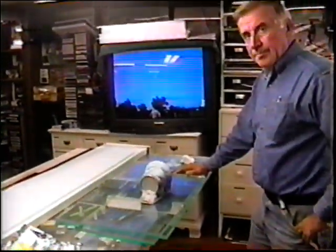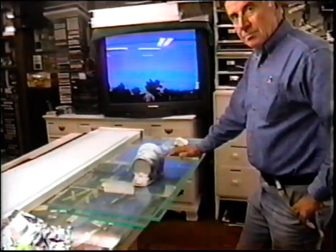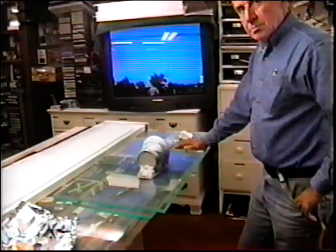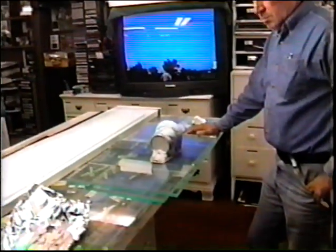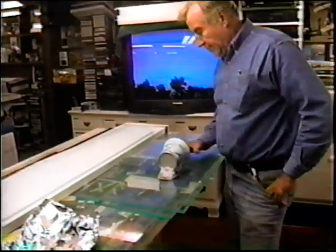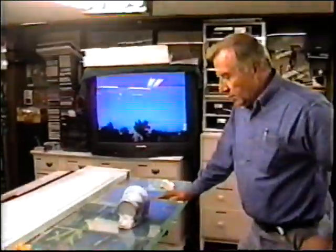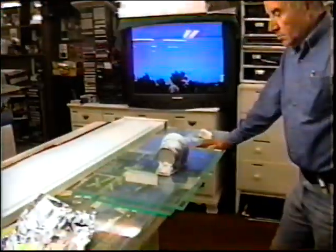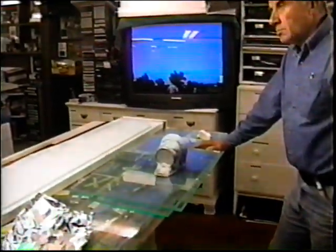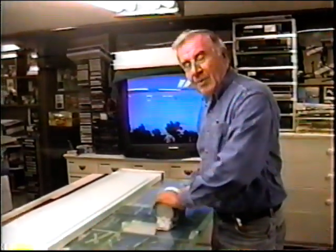I have to shoot this. Yeah, of course. It can't be brushed. You could brush it, but when you go to put the clear on with a spray gun, just keep putting it on. Put 100 coats on. It doesn't matter what it weighs. No lines, no bumps. Because when it's done, you're done forever. You've got to pay the price now. If you've got lines or bumps on it and you pour in $100 worth of rubber, it's your mold, and it's never going to go away.